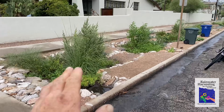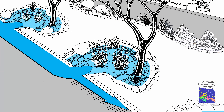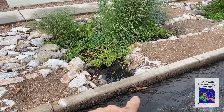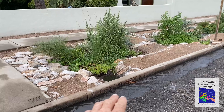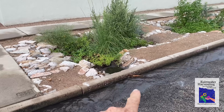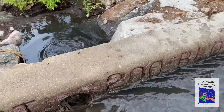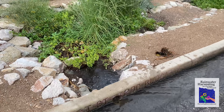We created a whole series of six street-side eddy basins. The first thing here is there's a four-inch diameter curb core, but you see this one — it got plugged with some debris. So the key thing for the adjoining homeowner and neighbors is you've got to come out before the rain, during the rain, during the rainy season, and regularly check this and make sure you remove any clog so all can work well. Super simple job, very rewarding.